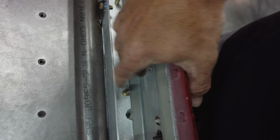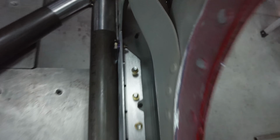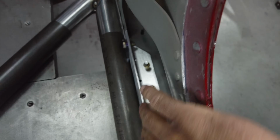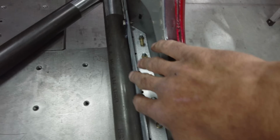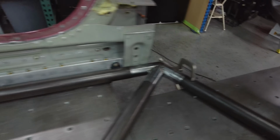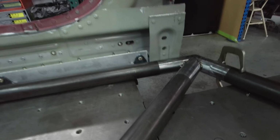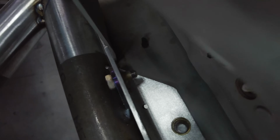This is all 1/8 inch plate that's been cut. It's aluminum, 1/8 inch aluminum. It's not angle, it's actually plate. It's cut, it's shaped, and it's set up with clecos right now, but there's 3/16 holes, and they are staggered. We just have the clecos in the top or the outside line. But what'll happen is this will all get riveted from the bottom, and that's just one area of the car, and this spans from your A pillar all the way back to your C pillar, and that secures that whole lower door sill. Now there's 4 pickup points on that go to the chassis with all chromoly tabs, and then there's nut plates on the back there.